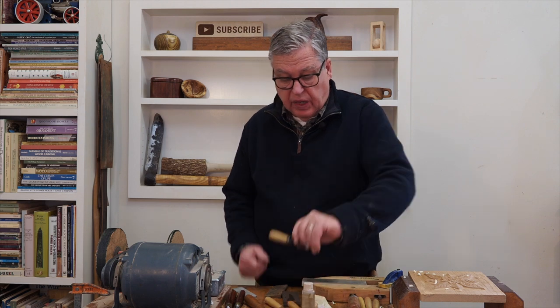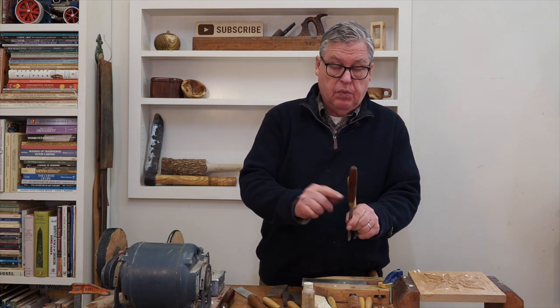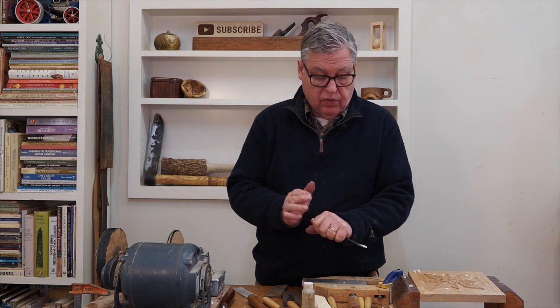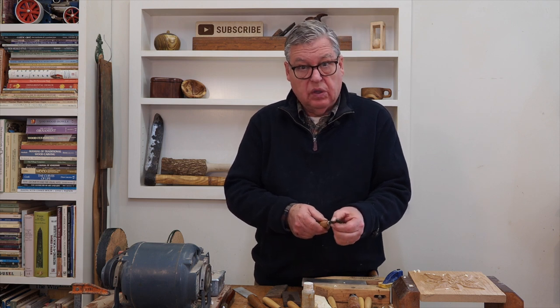So in a nutshell, it might be worth considering. You need to be prepared — when you take a tool out of the box just off the shelf like that, you're going to have to get it honed and get it shaped right in order to get a good result, and stay with the really softer woods. If you're just going to explore, give it a go — you don't have too much into it. But be careful, they get dull quick. And being short like this, there's no shoulder on the tool to keep it from driving into the handle, so you would never drive these with a mallet. For a professional carver, this is a little too short of a handle. But it is a very low investment to just give it a try.